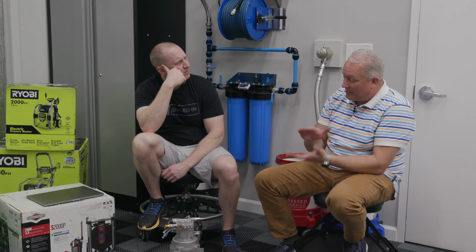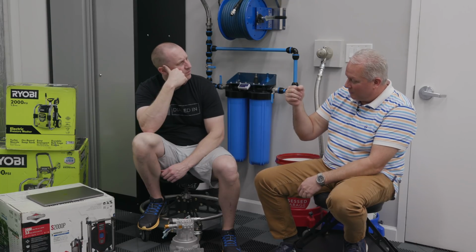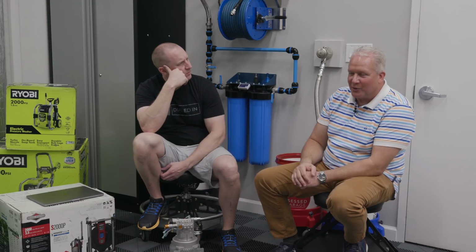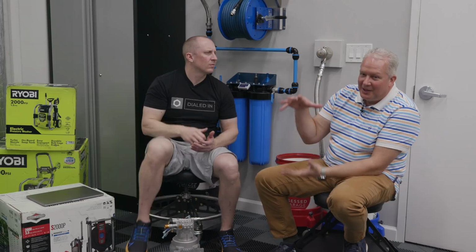So if you put a greater angle on your wobble plate, it's going to be pulling the piston down farther, basically doing a stroker motor. You're getting more displacement out of the engine. Same thing here, you're putting a greater angle wobble plate in there, you're getting more displacement out of that pump. Well, when you do that, you're going to require more power out of the motor.